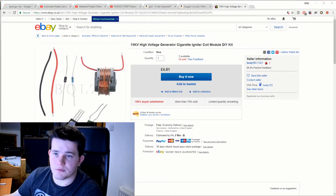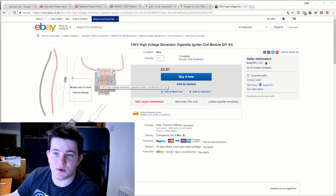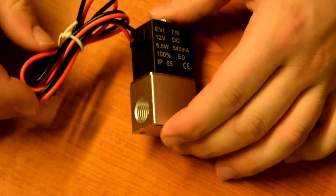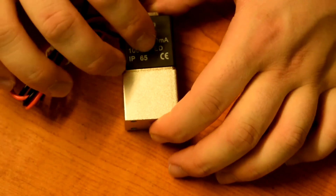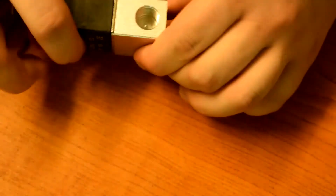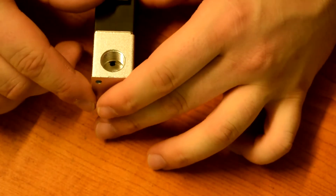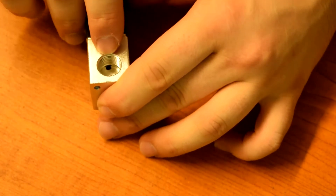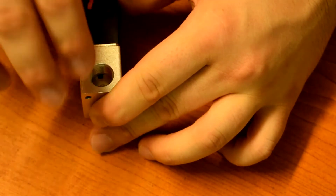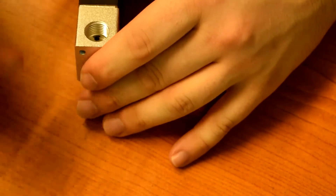This is the spark generator module I've gone for — really nice and cheap, though quite easy to burn out. Be careful with the secondary winding — it's really fine gauge wire. This is a 12-volt DC solenoid valve: you put 12 volts DC in, there's a little magnetic coil inside, and it opens and closes the valve. There are quarter-inch NPT fittings on each side — quarter inch is probably overkill, you can get this in eighth inch as well. There's a bit of a bottleneck inside — a tiny hole the gas has to go through — so trying to open it up as much as possible is kind of pointless with this solenoid.